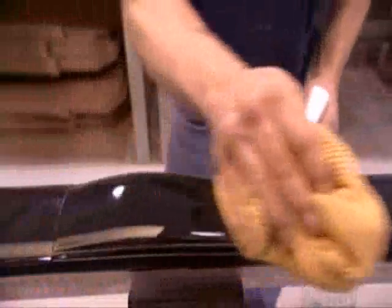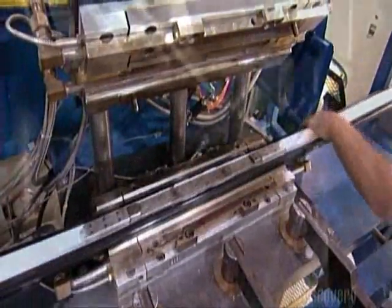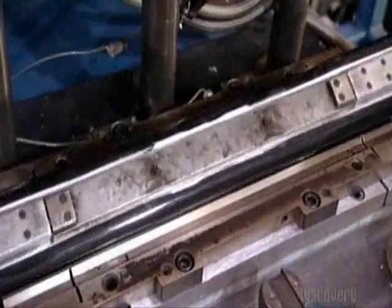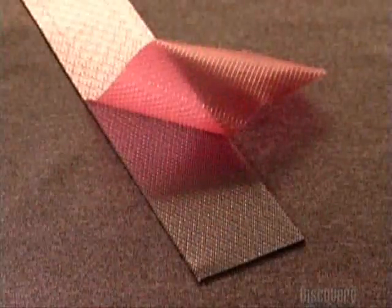He covers it with a piece of thermoplastic urethane, and again uses a heat gun to join the pieces. He wipes it clean with alcohol. Then he heats it up in a mold for a minute or two. The spliced section melts together, and then cool water hardens it. There's no seam line where the handrail loop could break — no loopholes that could cause any trouble. And that's the inside story on the escalator handrail, something to think about when you're on your way up.